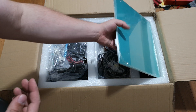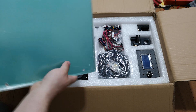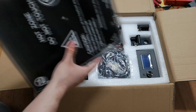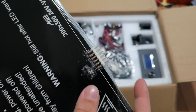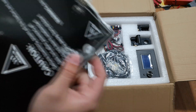The main issues I've heard with Anets are the power supply and the MOSFETs that control the hotbed and, to a lesser extent, the nozzle. So we have our hotbed here, which is an aluminum substrate with tempered glass, I imagine. Quite a bit of flux left from where they were soldering that connector on there - seems not great.